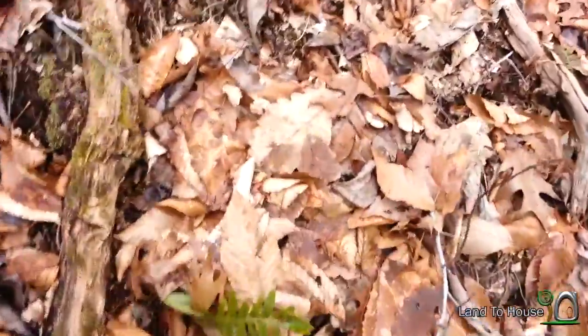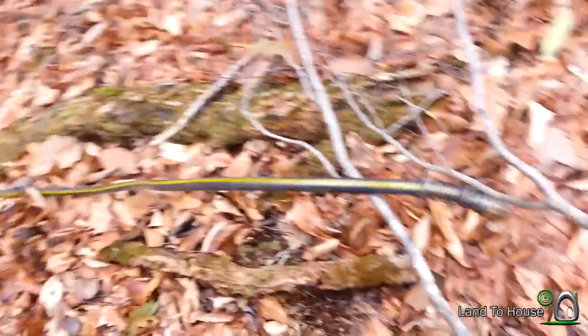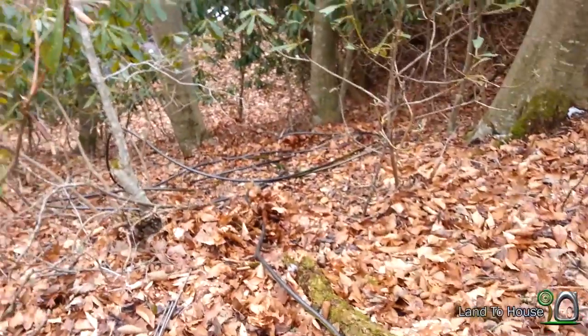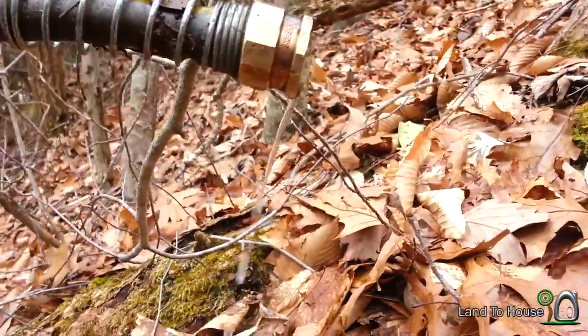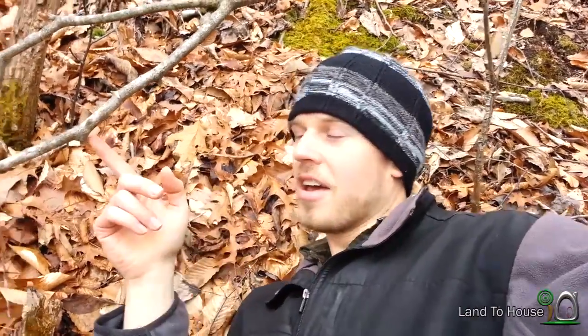Let's bring it up a little bit — see if I can kill myself falling. Somewhere between right there and right here we should find the cutoff pressure of this system. I'm satisfied with this. You can see there's just a little thin stream of water coming out of here. I'm actually impressed because I'm guessing we have around two feet of head coming in, and I'm way up here. I'd like to take the one-way valve and insert it where the two hoses connect, and hopefully the surging effect of the pump will build pressure, push through that one-way valve — open, close — and push higher than this point. Let's try it out.